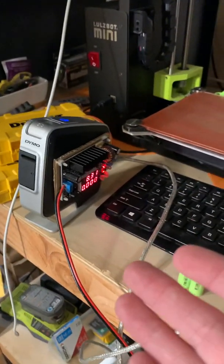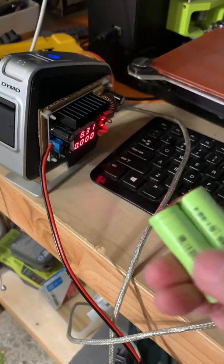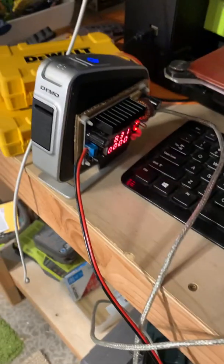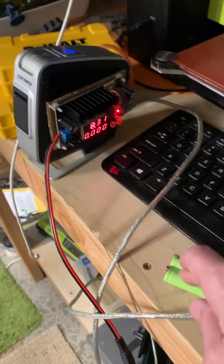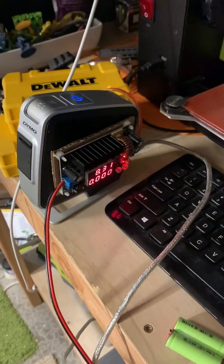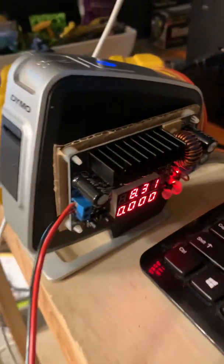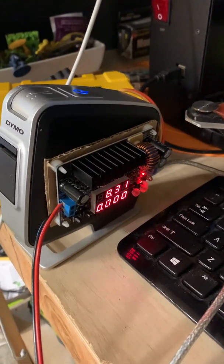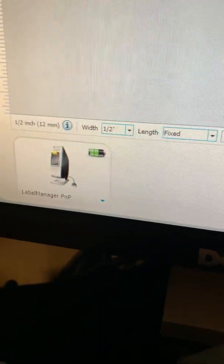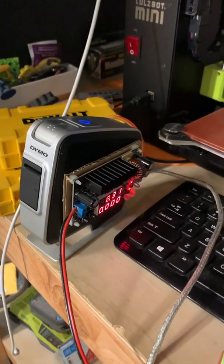The reason I did this retrofit in the first place is because I wasn't going to replace the lithium ion cells directly — I don't even know the size of these cells, and they come in a plastic case. The replacement battery pack costs nearly as much as a brand new printer. So here it's charging as it would. If we go to hit print on a label, let's watch to see if current draw actually happens, because I suspect the current no longer comes from USB — it dumps from the battery. That's actually why the software requires some charge on the battery before it can print, which is why this printer sat idle for a long time.